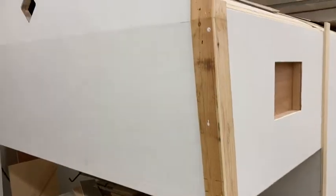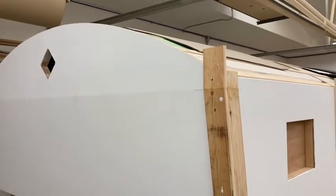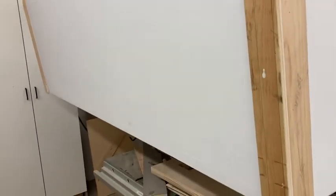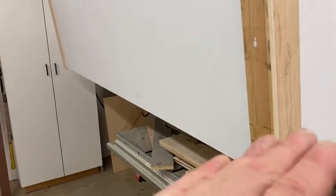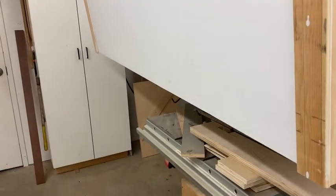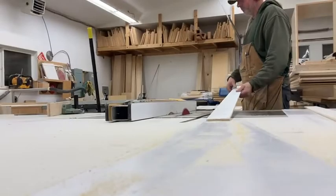Okay, I just ran to the store and got a few things, so I let this set up a little bit. The next thing I want to do is cut this trim piece here. It's going to need a bevel, top and bottom, parallel bevels at 7 degrees. And this piece will have to be cut down the middle and then make 2 opposing bevels. Splitting at 7 degrees would be 3.5. I did a test, I think 4 degrees. It'll make it a little bit more closed, and work better with the adhesive behind it.